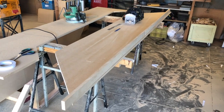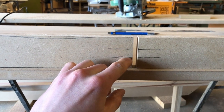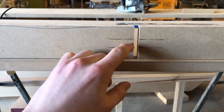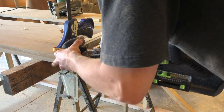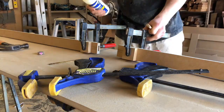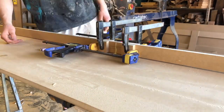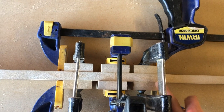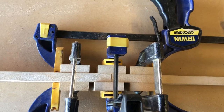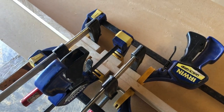So I've cut these two pieces here. There's going to be a little lip on the front to keep the cushion from moving around at all. I've got to have a join in there somewhere, so I'm going to do two dominoes close together so the holes will overlap and we'll end up with one big domino in the centre. I've got this single domino joint clamped together with blocks on either side so I can get clamps on there, and one in the middle to keep everything flat. I'll let that set up for an hour or so and then I can machine it flat again.